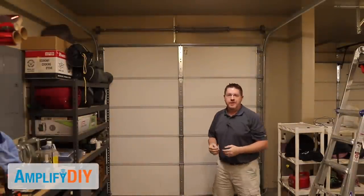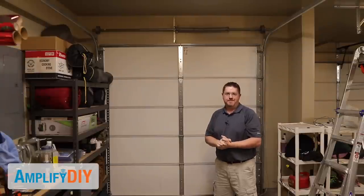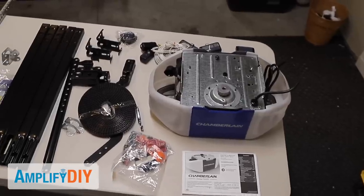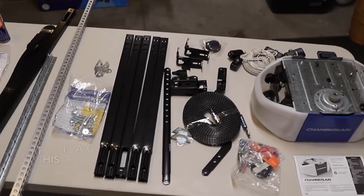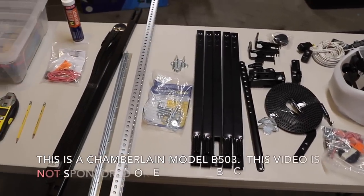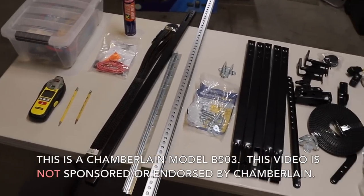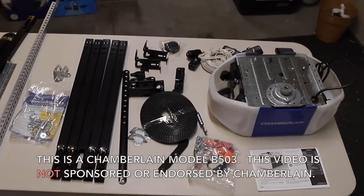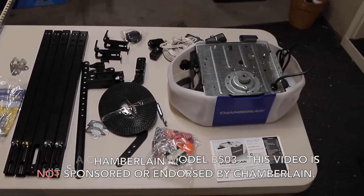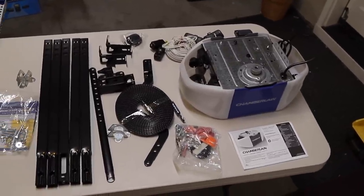In this video I'm going to show you how to install a garage door opener so that you don't have to open and close the garage door by hand. We've already unpacked the garage door opener — this one came off of Amazon. You can get openers like this just about anywhere online. This one's a half horsepower, which is the right size for most residential garage doors. If yours is made of wood or some extra heavy material, you might need to move up to three quarter horsepower or larger.